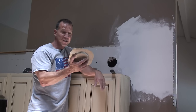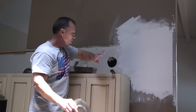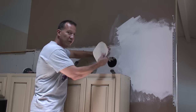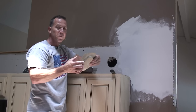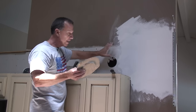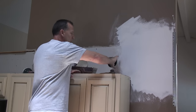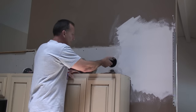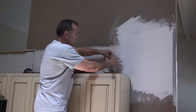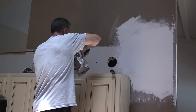This is what I love about butterfly patches. You can take three-eighths inch, half inch, or even three-quarter inch drywall and fill a plug in here on your wall. This is half inch right here, but if I had three-eighths, I could fill it with a half inch or three-quarter and vice versa. The reason is you're making a butterfly patch — it's not touching anything behind it. I don't have to put a piece of wood or anything behind this. What makes it strong is the fact that you're putting mud all in here. We fill that up with mud, push this in, and it fills just about all of that gap. Then when you float over it, it's strong.